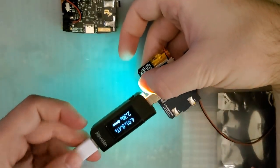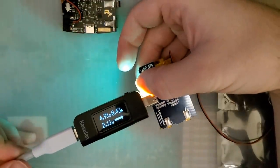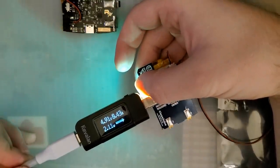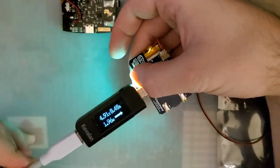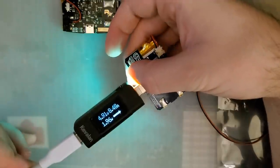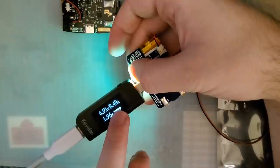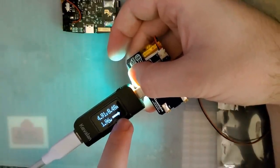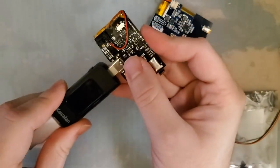That is insanely bright. Both those lights means it's charging, and it has successfully negotiated 5 volts. So it should charge just fine off of any USB-C host device. God, that is so bright. Okay. That genuinely hurts my eyes without my thumb over it. Interesting note, this charger does support a maximum of 3 amps at 5 volts. I noticed this is not charging at that. I don't know if we need a special charger for that, but yeah. Anyway, let's check out the Retro Modding one.